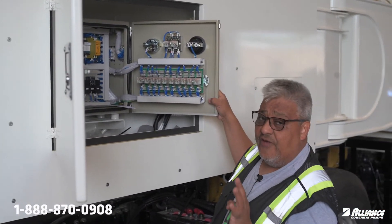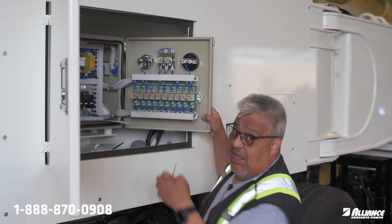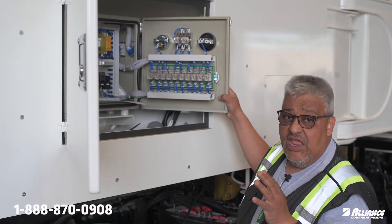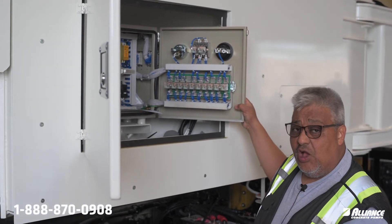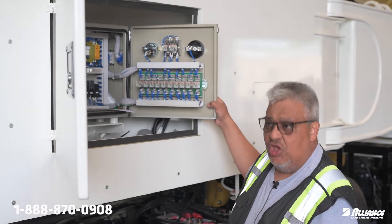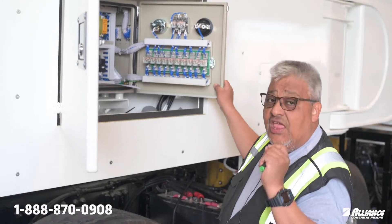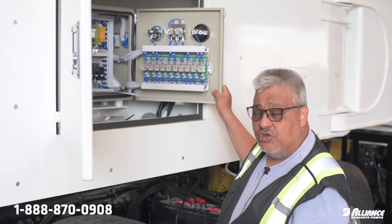Because we have to be careful when we throttle down for any reason, we use a relay. The relay will send a signal for the e-stop, for throttle down, to make sure that everything stops when you hit the e-stop or when you throttle down completely from the cab. So if you have a standard truck, the fact that you push the clutch or you release the brake will activate the signal, and that will force the truck to slow down RPM minus to idle.